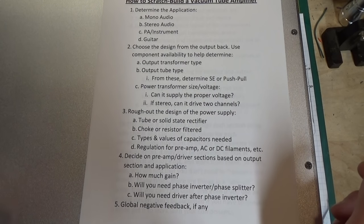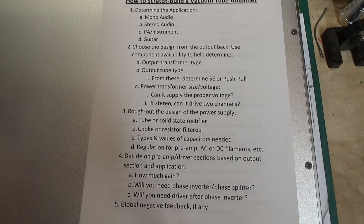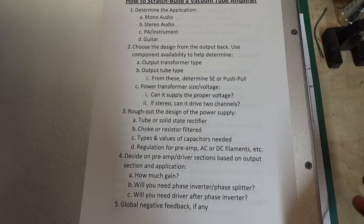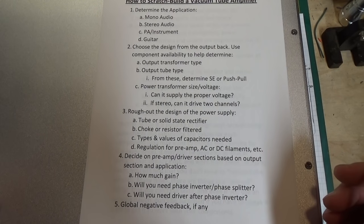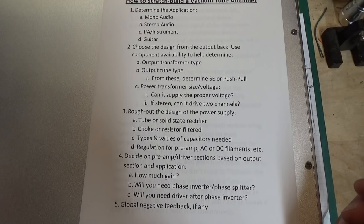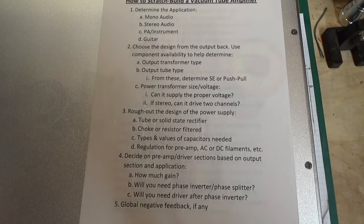You want to understand that a 3- to 5-watt amplifier can have the same good sound as a 100-watt amplifier, just not as loud. So when you're listening at low volume levels, both amplifiers can perform very similarly. If you're not worried about high volume and just worried about sound and performance, you may not necessarily need to spend the money on a very high-powered amplifier. The other downside of a high-powered amplifier is that big tubes require big power supplies. Let me get a couple of tubes out to show you what I'm talking about.